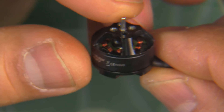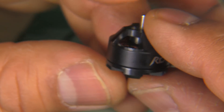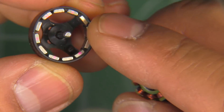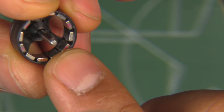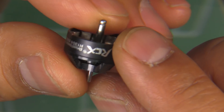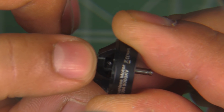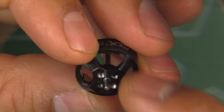Typical RCX type of motor. It's supposed to be made out of 7075 aluminum — a pretty well-made motor. Let's pull it apart. As you can see, it has a 2mm shaft, which has a slight advantage over some of the 1104 through 1106 motors which use 1.5mm. That's a slightly larger diameter shaft so it should be stronger. A good thing on this motor is that they use a grub screw on the shaft.